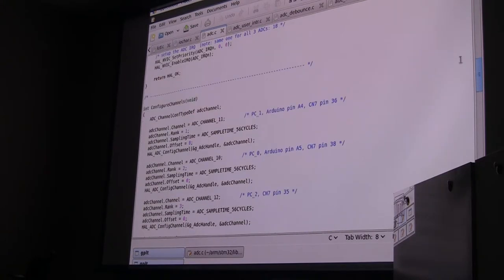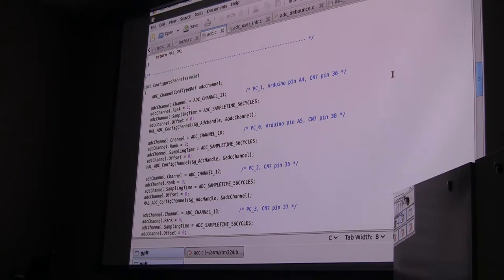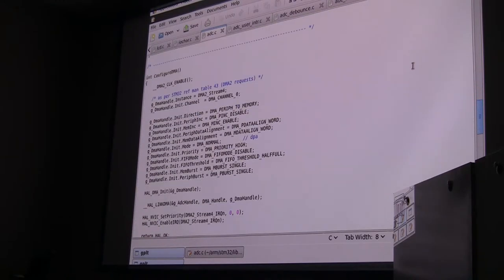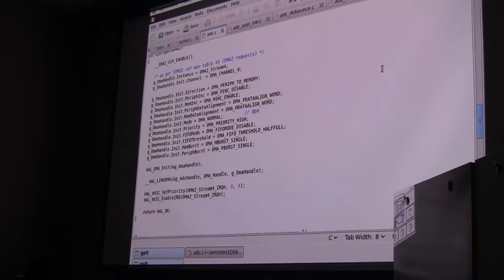Now, this is where it gets complicated. You're going to configure each one of these channels, and you have to tell them what order they need to be in. That's what rank means. So channel 11 is rank 1, and it's 56 cycles to complete one sample, and there's no offset, and there's the handle that we set up previously and the channel we set up previously. Now we're going to do that for all four of our channels. And here we're going to configure the DMA, which I'm going to skip over, but which is pretty cool.